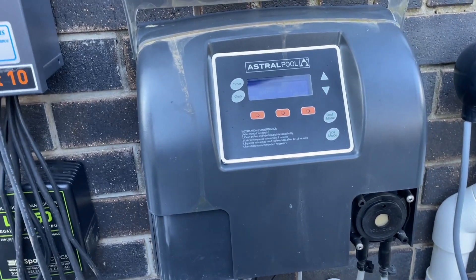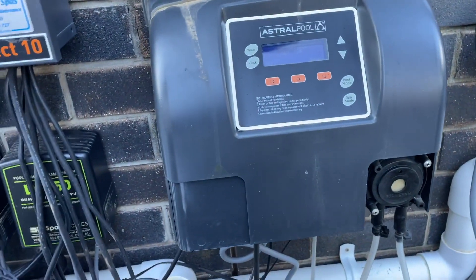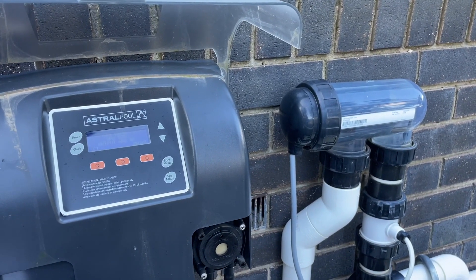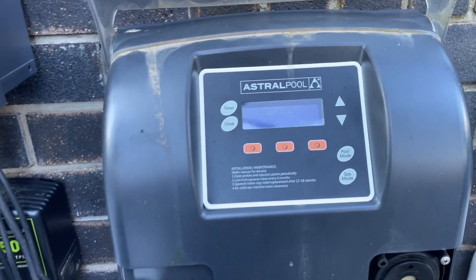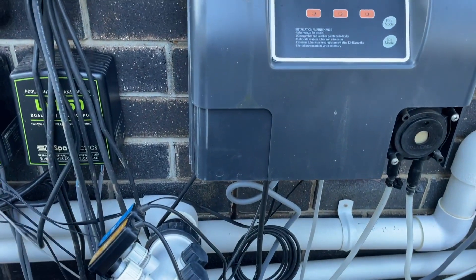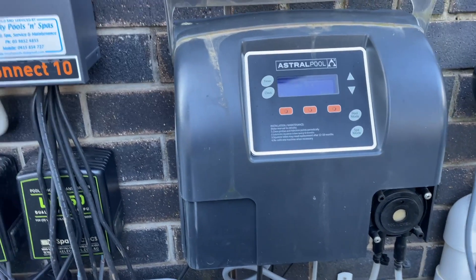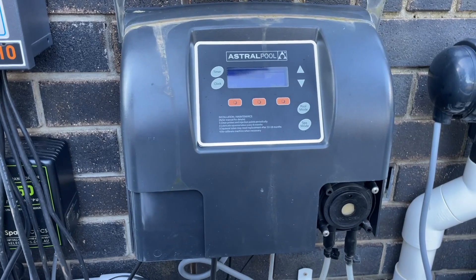That's why I'm selling the K-Claw — brilliant unit. It just means coming into summer you've got to adjust it up a little bit every month, and coming out of summer you adjust it down a little bit. But it's not going to overdose and put a whole five-liter bottle of acid in your pool, and it's not going to make your chlorine level go over 20 parts per million. My recommendation from Olympic Pool and Spa Service is we don't yet have the technology to get something that's going to last beyond a couple of years. I'll put a link in the description — if you want to buy one of those K-Claw chlorinators, have a look at the video where I talk about it and why I recommend them, because the build quality is so good.